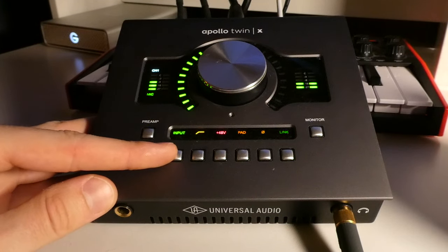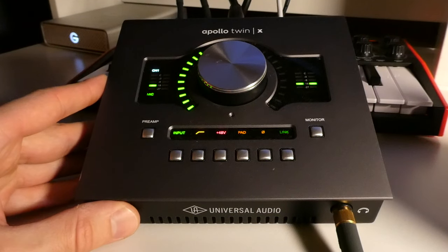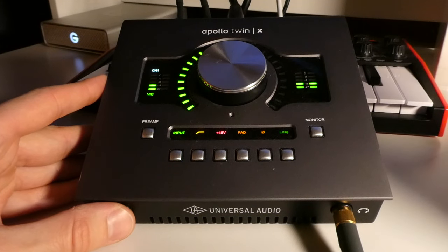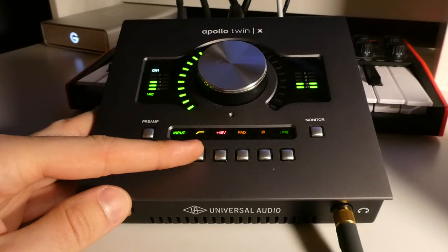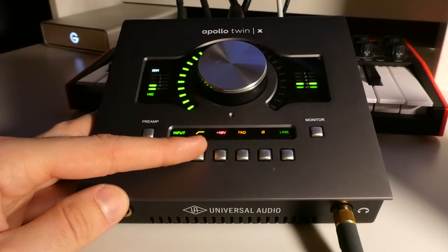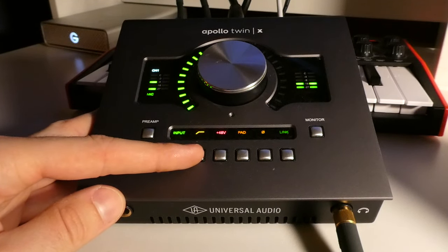The second button right here is the input. This is going to switch between our channels or the high Z input right here. And what this is for is an electric guitar, a bass, or an acoustic electric, and that way you can record straight into Logic. This button right here is a roll-off. It'll roll off the low end, and that way if you're tracking a vocal, you have to do less EQing in post, which saves you a lot of time actually. It just cleans it all up really nicely.